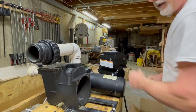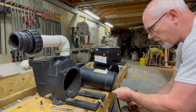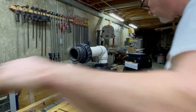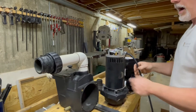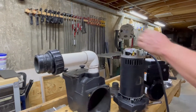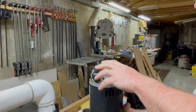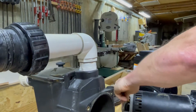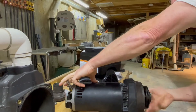Now we need to take off the back of the motor so we can stop the shaft from turning to get the impeller off — this is where you use the 1/4 inch socket. This is also where we're going to disconnect our wiring to run back to the new pump. Use the 7/16 wrench here. Sometimes it's not easy to get it on the shaft — a pump wrench is probably easier because it's made for just that. Just unscrew the impeller in the counterclockwise direction to come right off the shaft.